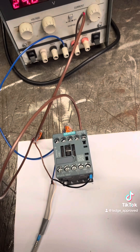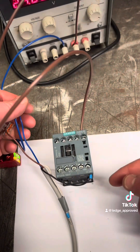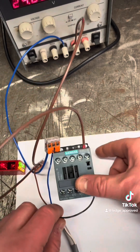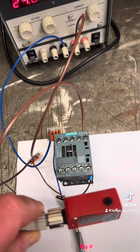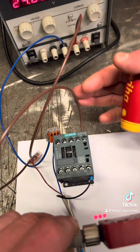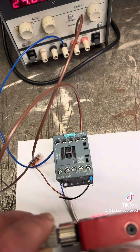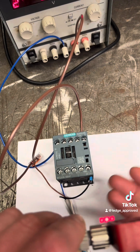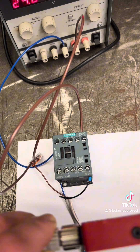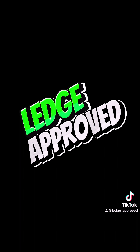Then with your NPN it's completely the opposite. So what we've got — we've still got a common 24 and common zero — but now what we're wiring in is we've got permanent 24 down to our coil and our contact, and then we're now switching on the neutral, the zero volts. As you can see, that's working — you've got your 24 coming down to the coil on your contact, then we're switching to zero volts, because until that's made you've got no path down to zero. Now if you've made it this far, you're definitely legend approved.